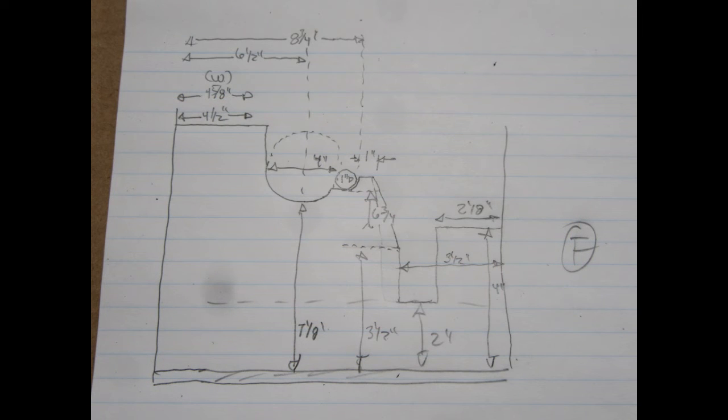Next, the instrument is placed back in the desired position in the case, and at the intended position of this pillow block, a number of measurements are made from the front, rear, and bottom of the case and to the places where the pillow block will contact the instrument. A large caliper is used to measure instrument diameter at the critical places.